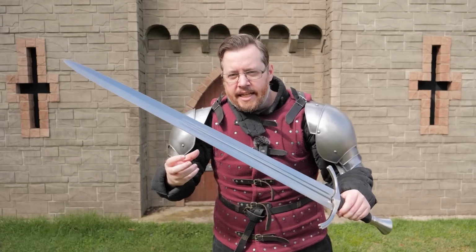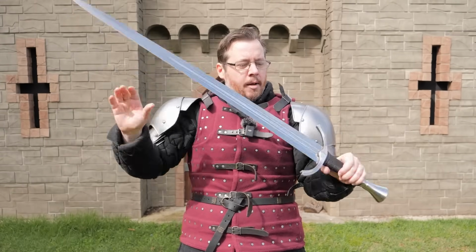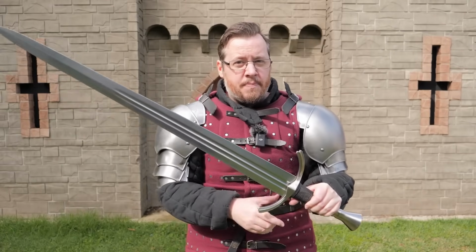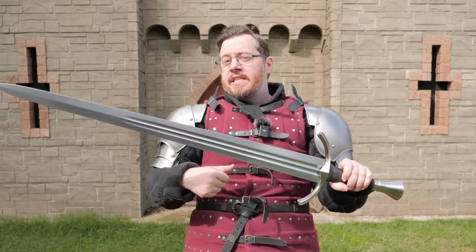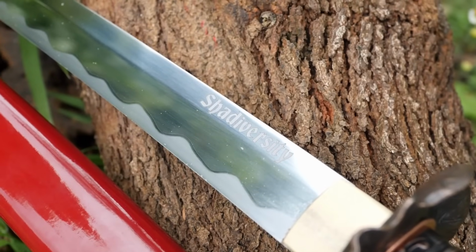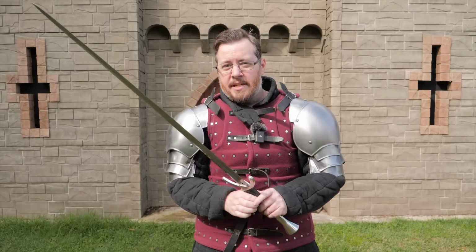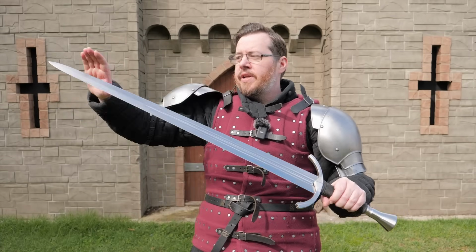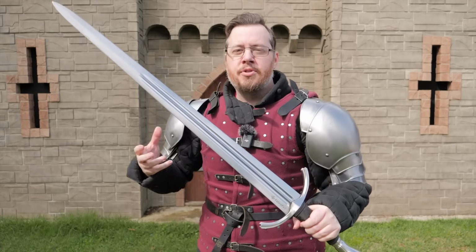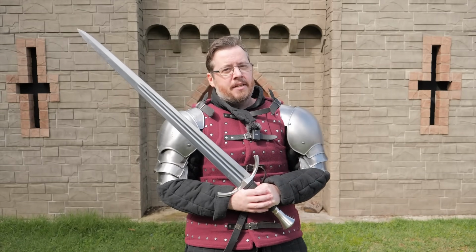There is such an intriguing, complex interplay between these steel structures, not just in how it can work in a regular blade, but also you can make a blade to have different carbon contents by utilizing different grades of steel and then cooling it down at different rates, having it adopt different grain structures as well, which is what we see in the katana as well as many European blades like the ones coming out of Toledo. There are pros and cons to those methods, as well as adding other elements to iron on top of just carbon. Adding a little bit of silicon can also increase that flexibility, and that's where we come to much more sophisticated and complex modern types of steels, but that is a subject for another video.